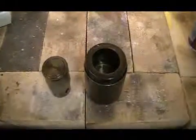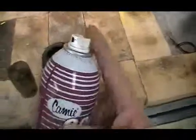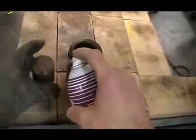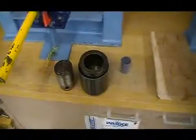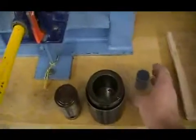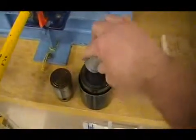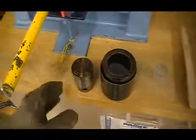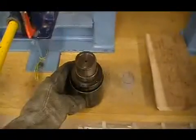Okay, we need to spray the inside of the mold with a release agent. This will allow us to get the plastic keychain out of the mold when it's done. So your instructor will spray both halves. The molds will be carried over to the hydraulic press. You'll pour the contents of your cup into the compression molding, and the top plunger will be placed over the phenolic powder.